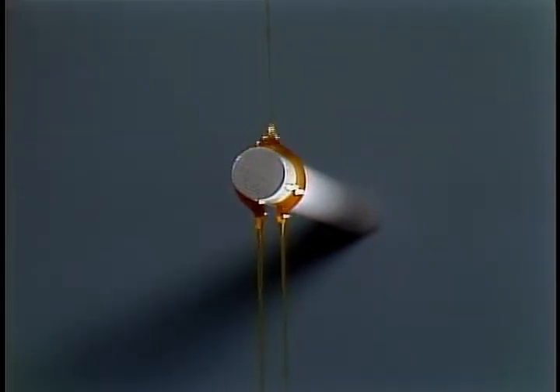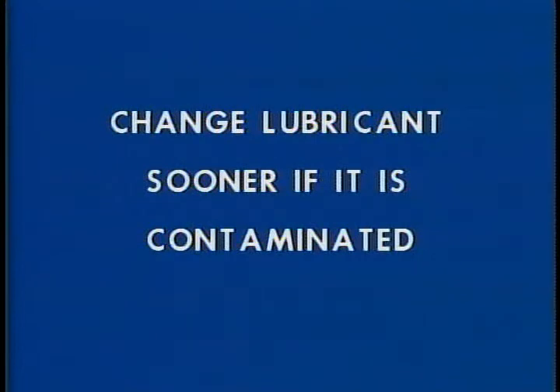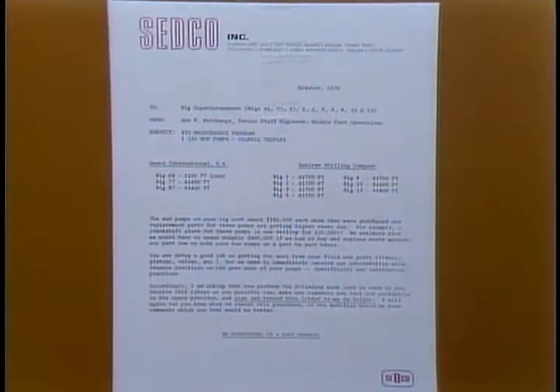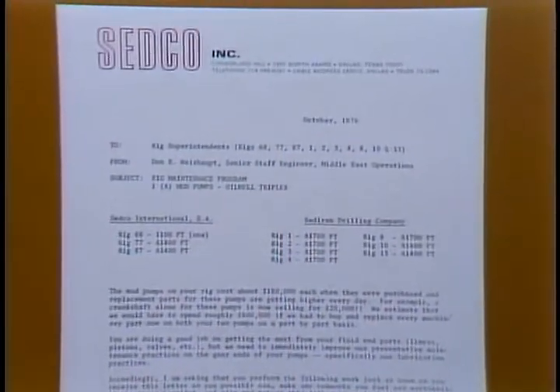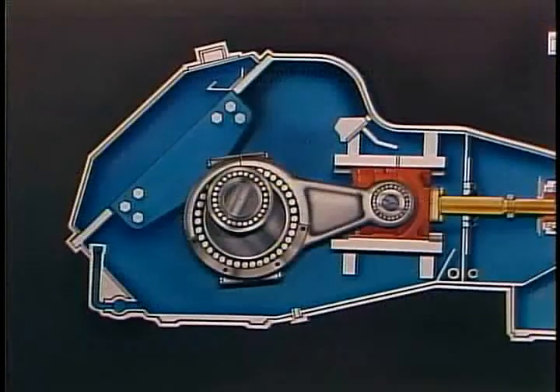What about changing the oil? Most pump manufacturers recommend you change the oil at least every six months. This is the absolute longest your mud pump should go without an oil change. In most cases, the oil is changed more often. Anytime you find contaminants in the oil, it should be changed. Be sure you follow the guidelines sent from the Dallas office concerning the recommended interval between routine oil changes. In some areas, six months may always be too long.